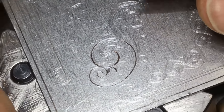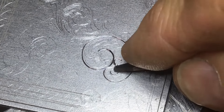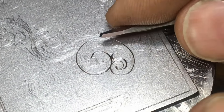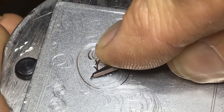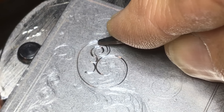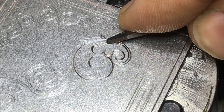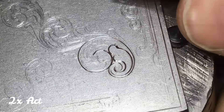Mild steel practice plates are like butter — they're wonderful to cut, but they're also a little bit sticky. As I reach the end of my cut up here at the tip of the leaf, I'm going to roll my graver hard left and create a flare at the tip of that leaf. It'll give it some depth.